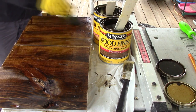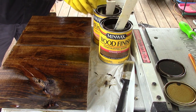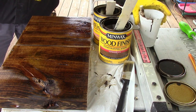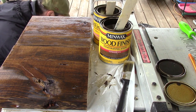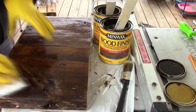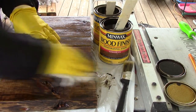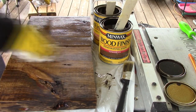Let's briefly talk about staining. Whatever color you want to do is perfectly fine. I wanted a darker color — if you like this color, it pretty much came from some golden oak with a little bit of cappuccino mixed in. I just applied that with a brush and then at the end used a paper towel to wipe off the excess.